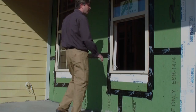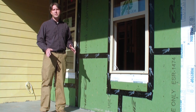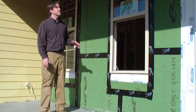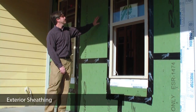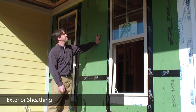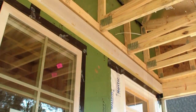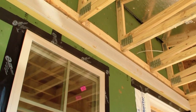In part one, I'm going to walk through this home and look for the framing to ensure it's in place and ready for insulation. The first thing I notice as I walk onto the front porch is that the framer has extended the exterior sheathing from the first floor continuously to the second floor, so this porch roof is separated from the floor system inside.